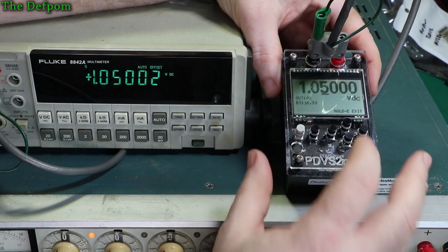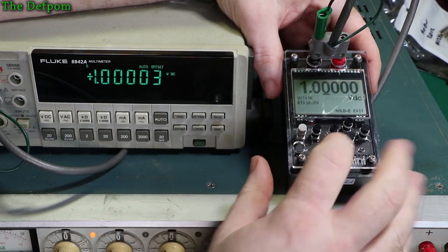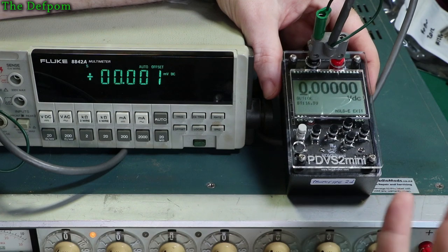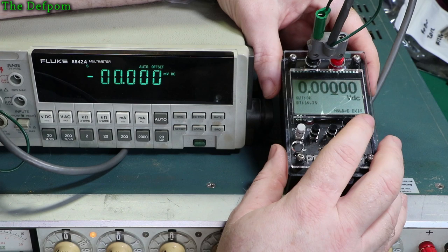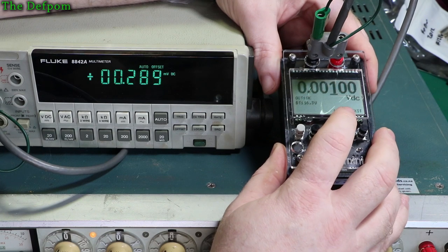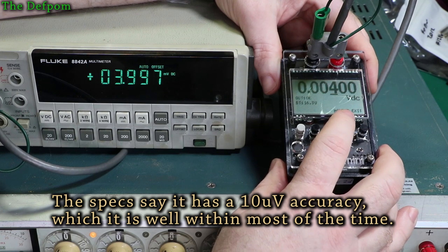This is the prototype — for me to try out and see if I can find anything really. That's the whole purpose: find what further refinements are needed. What I'm showing is a slight error on that very low range — in my case. Whether it's this meter being a bit funny, whether it's EMI causing reading anomalies, or whether it's such a low voltage output on that section causing calibration issues — I'm not certain. I need more reference calibration points for these lower levels. At one millivolt steps around 987-988 the readings are mostly consistent, though some steps show a difference of about three counts.